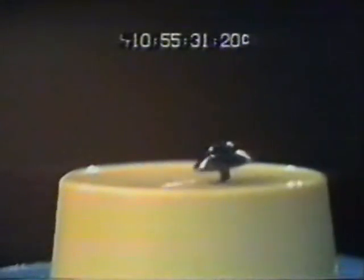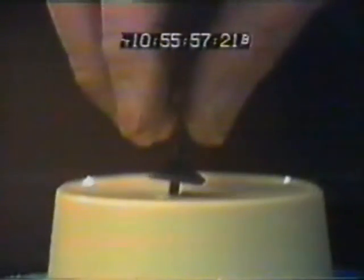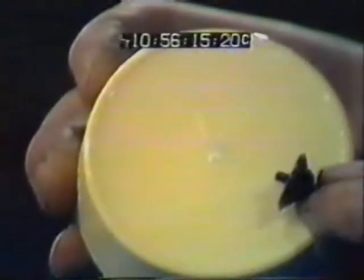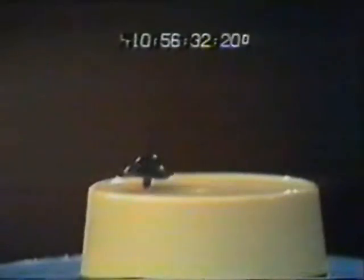Our little fellow here has done very well — it's a perpetual motion machine in a sense. How long do you think we'd have to wait for that top to stop? Well, I can tell you you would have to wait five and a half days and nights. Inside there there's a whole box of electronics — a little microchip with six transistors, an electromagnet in the center, a metal detecting device, and underneath the top there's a little bit of steel. When it gets near the center the metal detecting device triggers the electromagnet, and the underside of the top is so shaped that it runs along and gives it a lash like a whip — very like the old-fashioned whip-and-top idea. The top will keep going just as long as there is energy, and one very small pocket lamp battery will run it for five and a half days.